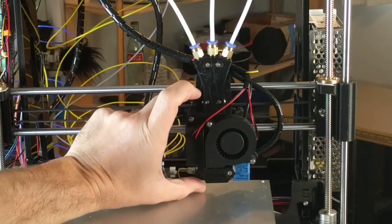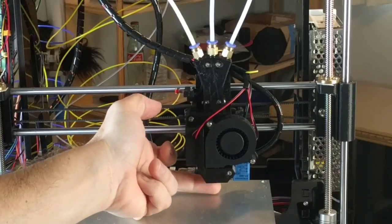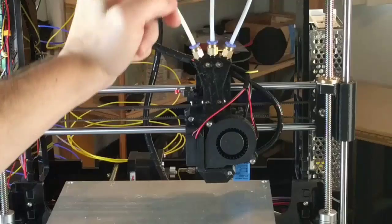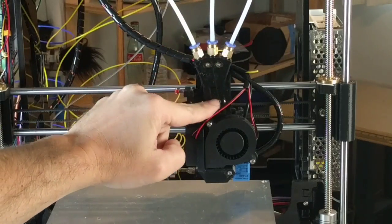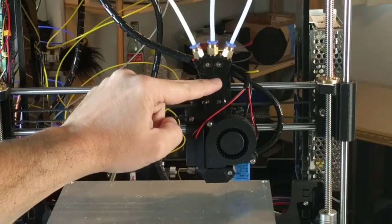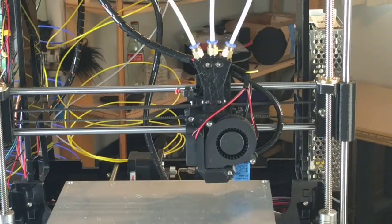The drawback is that this carriage has an 87mm retract. From the melt chamber up to where the filament needs to retract — because there's a shared line, all three colors can't be in the line at once, and they all join right here — so you have to pull each color back 87 millimeters between color changes. That slows the printer down a bit, but it's definitely workable.